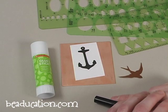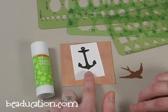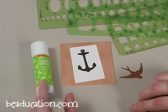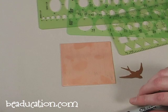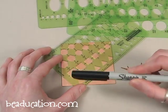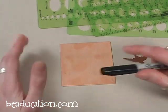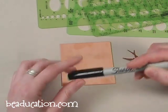When I saw or cut out my own shapes out of sheet metal, there are four different techniques I use. The first is to create my own paper template — I drew an anchor and filled it in with permanent marker to create a defined line, so when I'm sawing it's a nice guide. The second is using plastic templates to trace a shape. The third is to use a pre-existing shape and trace it. And the fourth and most wild is just to freehand it and draw whatever shape you'd like.